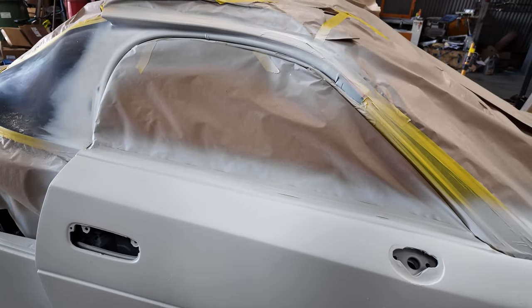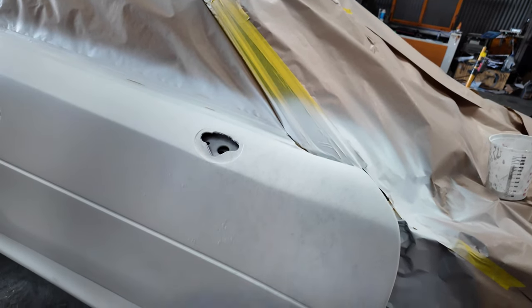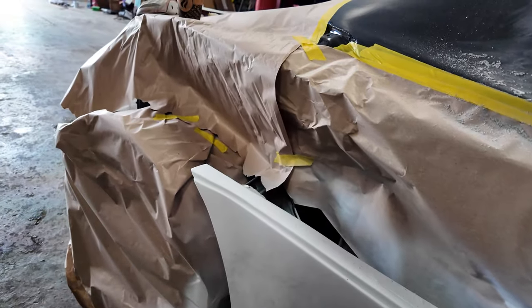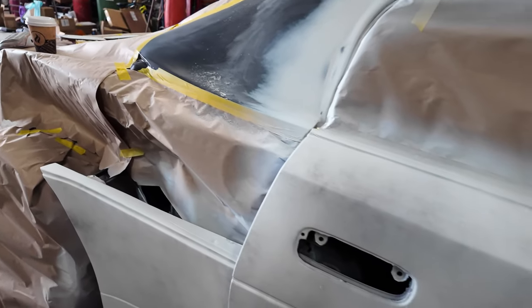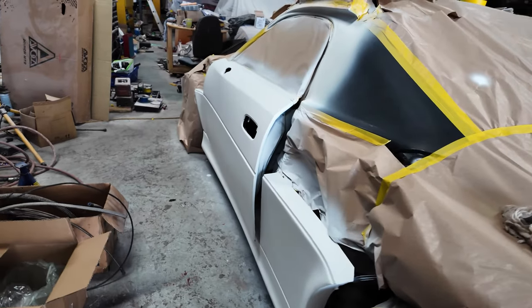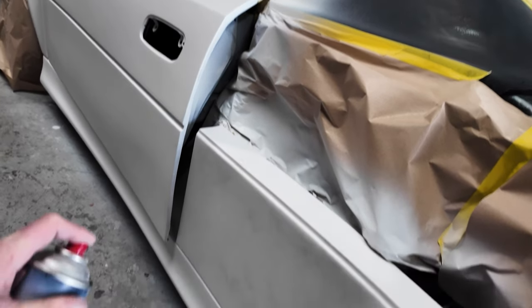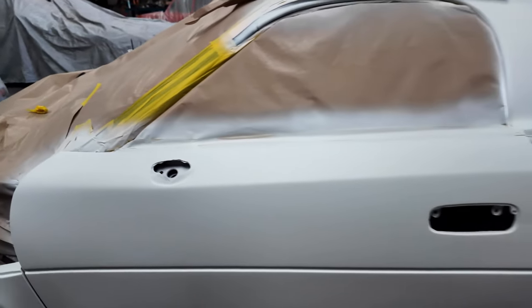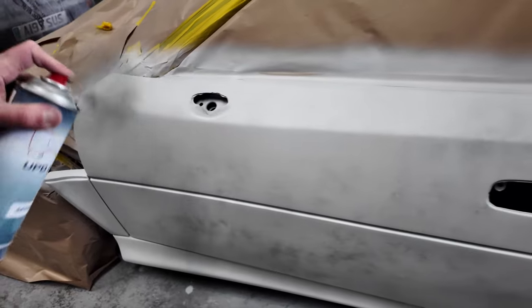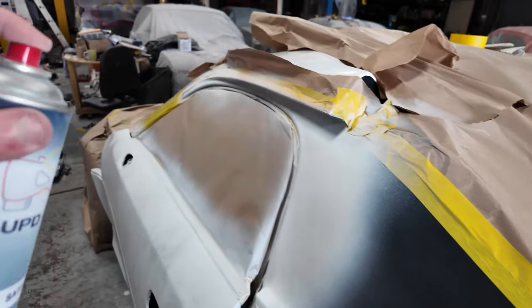So that's what I'm doing today. I'm going to spray a guide coat onto this, just to help us see where I've been — I can see the ups and downs as well. I just want a really light coat. Then I know everywhere that I've sanded, that I've hit it. Same on the other side. I'm not going to bother with the door handles because I can see that. Doesn't need a lot when you're doing a guide coat. You just want a tiny thin dust coat, especially on white. If you were working on grey primer you'd want a bit more guide coat, but on this, not so bad.